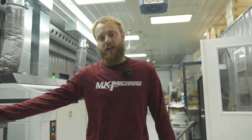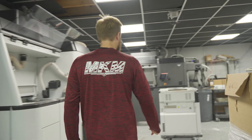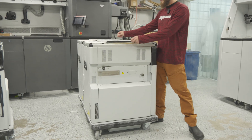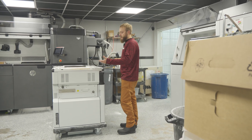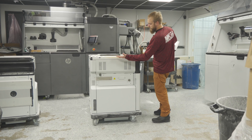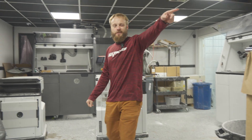They're cart-based, so carts slide in pre-loaded with material, make the parts, and then the parts stay in the carts before getting shoved into boxes. Carts get loaded with material which gets augered up on top. A platform drops down, displacing material below it upward, and you wind up with a chamber full of parts. From there they get shoved into a natural cooling box on the other side of this wall.